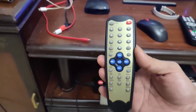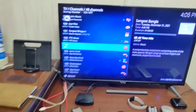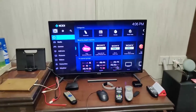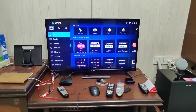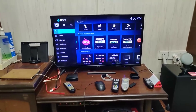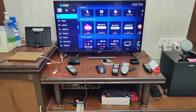Just like a normal set-top box, we've achieved making our own Geo TV IPTV set-top box using a Raspberry Pi 3, a remote, and a USB IR receiver. Just keep in mind that the remote you use has to generate unique scan codes — when you issue 'ir-keytable -t', check that the scan code being generated is unique. If that's the case, you can use any remote that works with the IR receiver. Hope this video helps you in setting up your own Geo set-top box. Share your feedback in the comments — thanks for watching, have a great day.